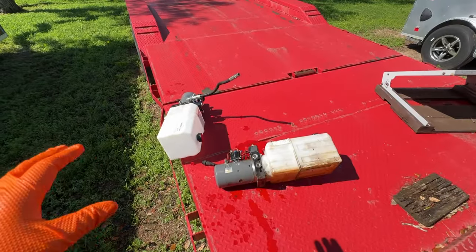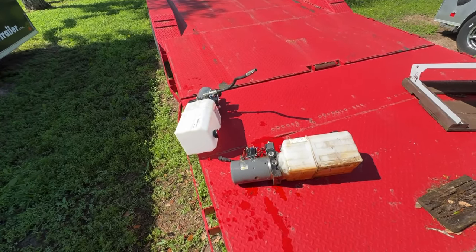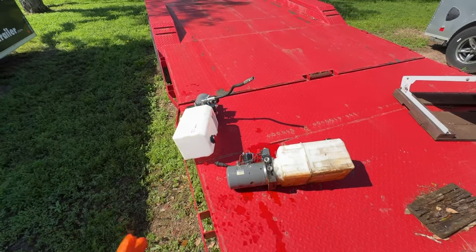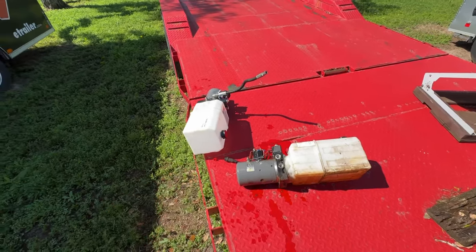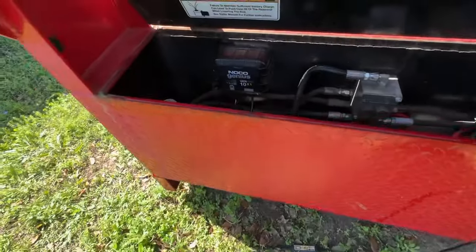Used my scraper and got quite a bit of it out — looks a lot better. I drilled six holes: two on that side, four on this side, just in case water gets in. Just need to clean up the metal shards but it looks much better. We've removed everything from the old pump and installed it on the new pump, tightened it all down. Just need to put it back in its spot, bolt it in place, and test it out. One thing I forgot to do is buy hydraulic fluid — I'm not going to reuse the old stuff just in case water got into it and possibly damaged the motor.